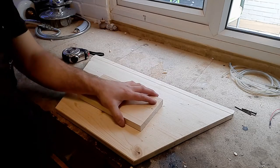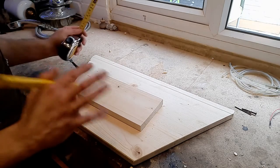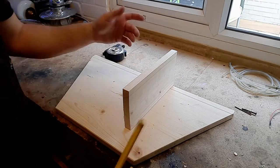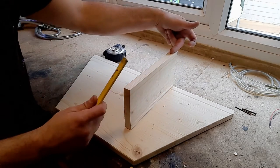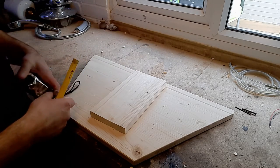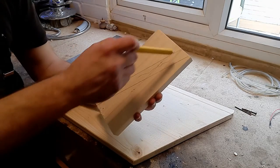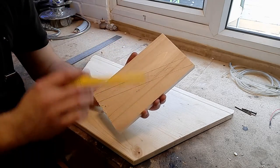I want to plane the tongue off and the beveled edge as well. So there's our blank. I've done a bit of working out off camera — I've roughly come up with my own calculation. I'm going to measure a centimeter to the edge here for the depth, but I don't want a massive lump so I want to start from a gradual measurement and work up to get bigger, bearing in mind I want to get two brackets out of this piece. So I'll measure a centimeter there and three centimeters here, mark those two lines up — and now I'm going to cut this section off within those lines so I can plane them down together later on.